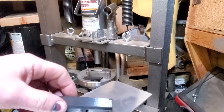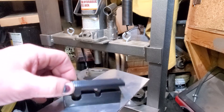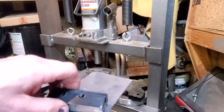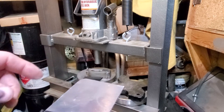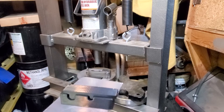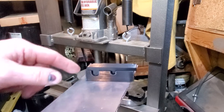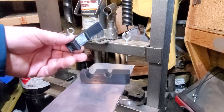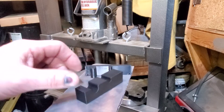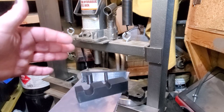This is actually a bad one — some of my stuff didn't line up quite right. The 3D printed piece is like this. I made it three-quarter inches wide, three-quarter inches tall, and three inches long. I built a steel block to house it just to keep it from flexing — I'm not sure if flexing would be an issue, but I did it to plan for the future. Now anytime I need to make a little press feature like this on a half-inch wide strip, it's three-quarter inches wide but I'm only using a half-inch strip in it.